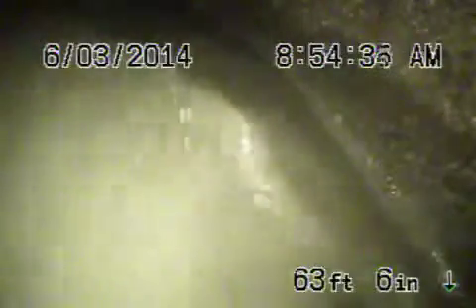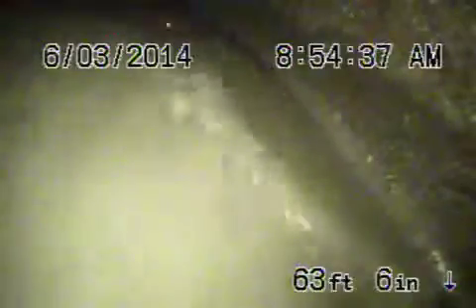We'll go ahead and pause the recording here. We're going to check the rest of the line. We're back on again from the four-inch clean-out where the pipe exits the house. The line's in pretty good condition. There's the city sewer and it's got a long six-inch lateral.